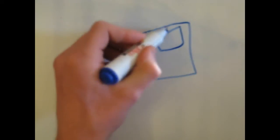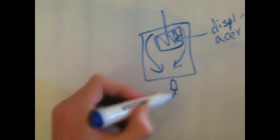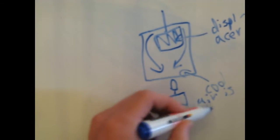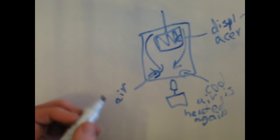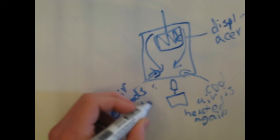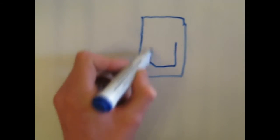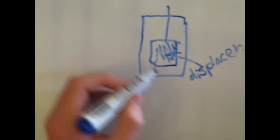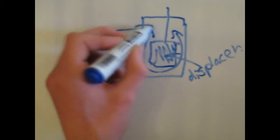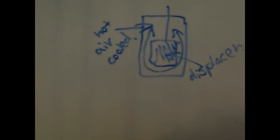The effect of the displacer is to help the air rise up and go back down again a lot faster than it would just done so. So altogether, as the displacer rises to the peak, the air is pushed back down to heat up, and the balloon is therefore pushed up, which helps turn over our engine. As the displacer is put down to the bottom, the air rises to the top and is cooled down, and this helps the elastic shrink and pull the crankcase down. This cycle continues, and this is what makes our Stirling engine turn over.